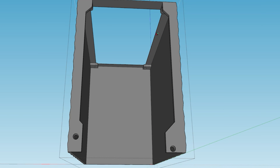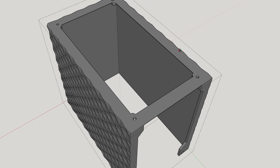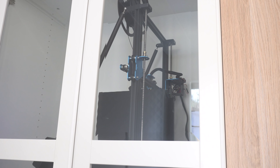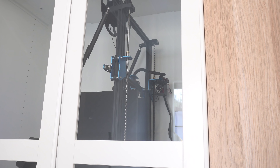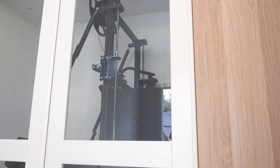For almost all the parts the printing went smooth, but I did encounter some warping issues on the case cover. Adding an internal brim a few layers thick really helped the print stick to the surface a lot better, and it turned out perfect on the first attempt after adding this. I printed the case cover inside a closet to protect it from sudden changes in temperature, as even the slightest wind from a door or window opening could potentially cause the part to cool too rapidly, causing cracks and warping when printing such big parts.